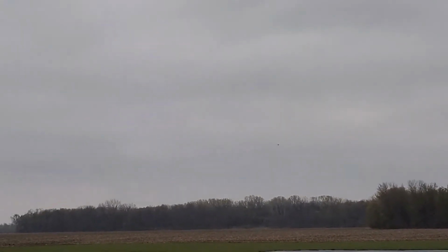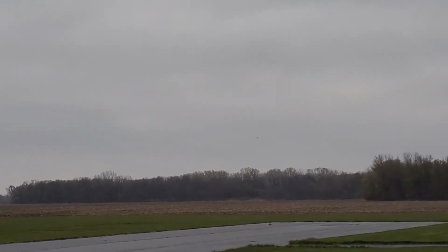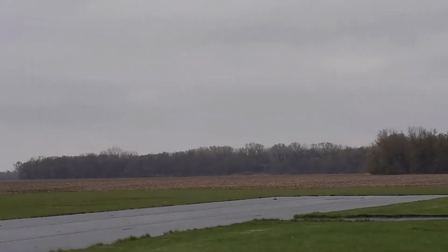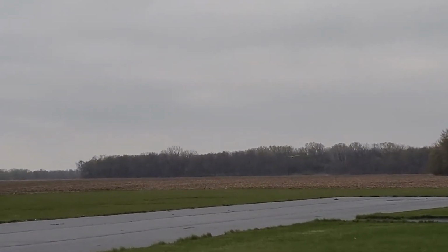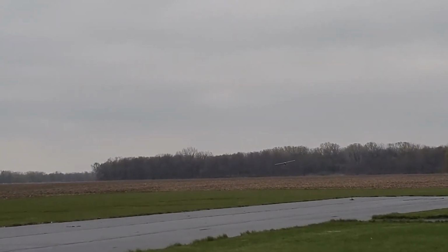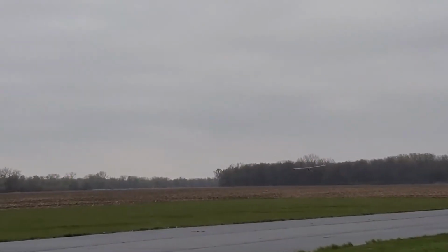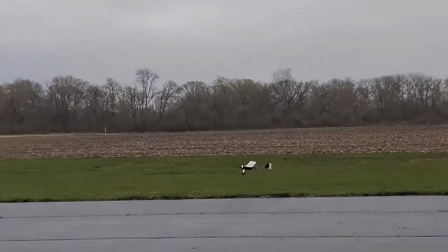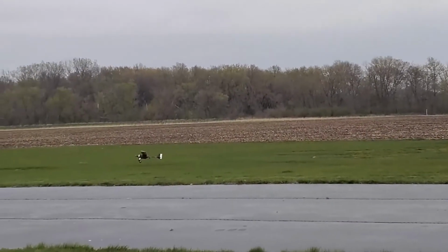Additional tests we have performed have been to test the stall and cruise airspeeds of the OpenUAS, which we have found to be about 12 meters per second and 23 meters per second respectively. So far we've flown the OpenUAS for as long as 15 minutes on one battery at an average power setting of roughly 85%. Future iterations of the OpenUAS designs will work to improve the stability of the aircraft as well as increasing range and decreasing the stall speed. Now to conclude the video, Chris and Alex.